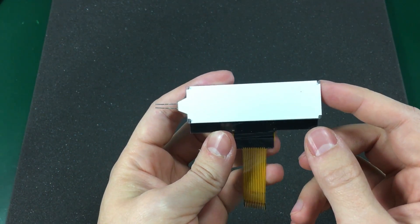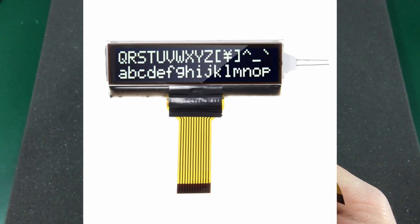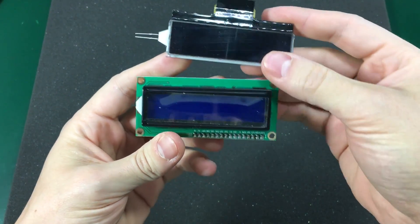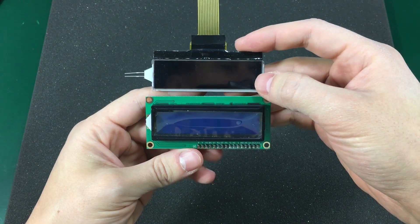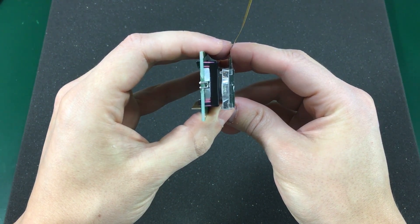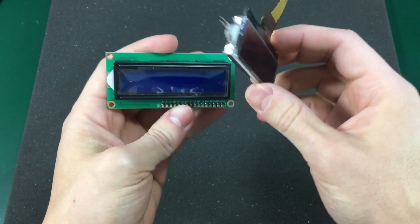The first item is this LCD. I haven't tested it yet, but I can show you a picture of how it should look. You can see it has white on black characters and it's a 16x2 character display. Obviously what caught my attention was the white on black characters, with no particular project in mind, but it looks nice and I wanted to have one. Also, it's a bit more compact than your standard 16x2 LCD module, as you can see right here compared with a standard module — it's a bit smaller, and this is because it has a chip on glass instead of the PCB module required to hold the driver ICs.